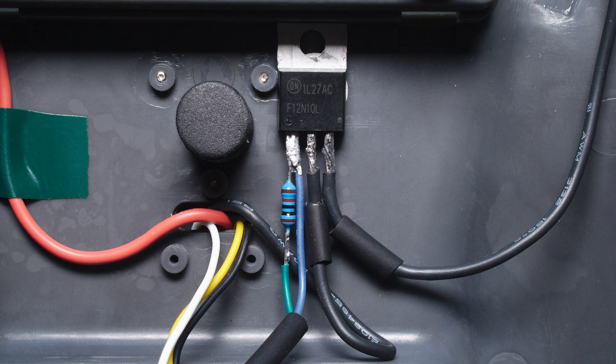Step 4. Shorten a piece of ground wire and solder it to the source pin of the MOSFET — that is the right pin. Put a bit of heat shrink on the contact to properly isolate the connection. I chose to shorten the legs of the MOSFET to just be long enough so I could solder everything up to them. To the center pin, the drain, solder the ground wire that is coming in from the external module bay. Don't forget to slide on a piece of heat shrink beforehand. To the left pin, the gate, solder the pull-down resistor so that the blue wire is closer to the FET. Again, don't forget to put the heat shrink on the wires before soldering them to the FET.